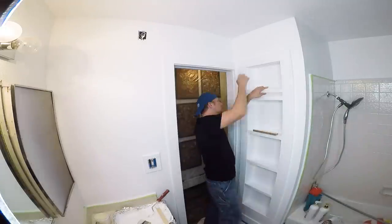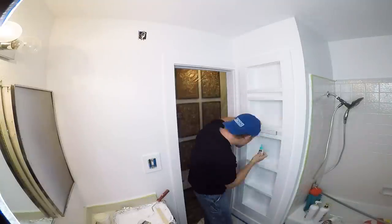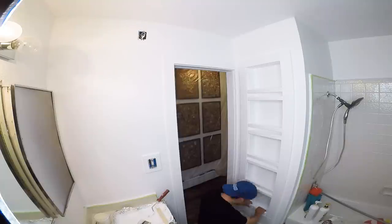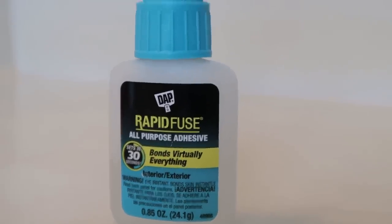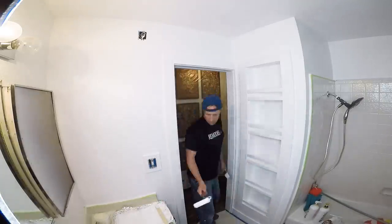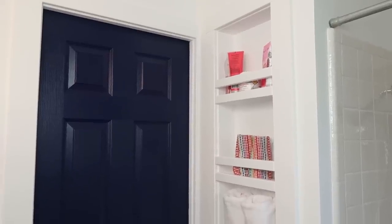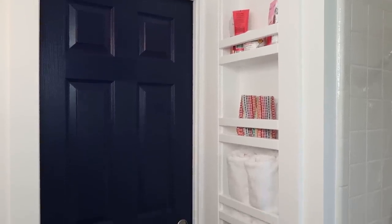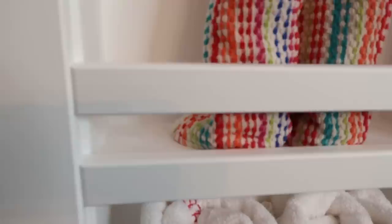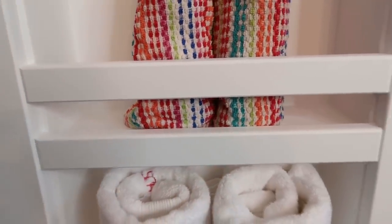Once all the shelves were painted, the last thing to do was install the little railing an inch and a half above each shelf. I ended up just gluing the rails in place with DAP Rapid Fuse glue, then touched everything up with a little bit of paint to finish it off. And there you have it — five new shelves in the bathroom, more space to store things and stay better organized. Give us a thumbs up if you could use more shelves in your bathroom, click here to download this project, and don't forget to subscribe. Thanks for watching!